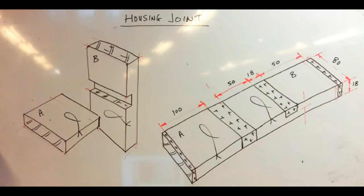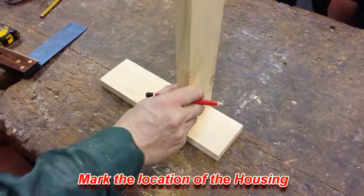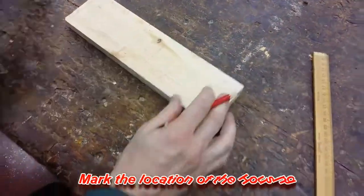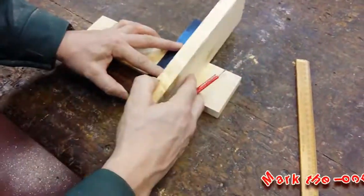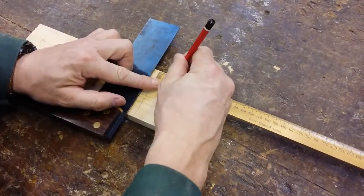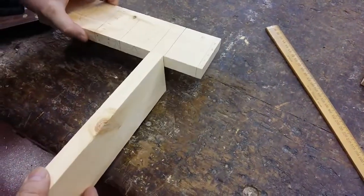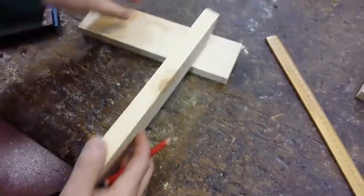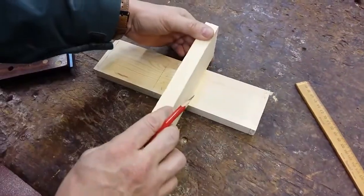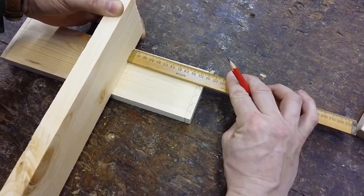We have a whiteboard drawing that includes the setting out of the piece. For the setting out, we mark the overall length to start with, and then we want to locate where the other piece goes into the housing. I've measured over 50 millimeters from the edge and demonstrated the thickness of the wood, then squared the line — measuring along the edge which is 20mm — using the tri-square from the face edge, and you can see it matches up to the thickness of the wood. If you want to center a piece on another section, you can offer it up to the end line, measure what's left, and divide by two.